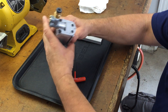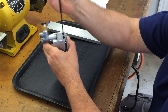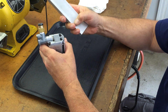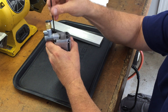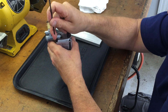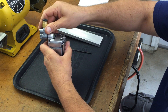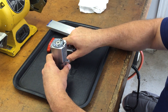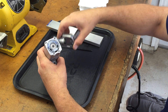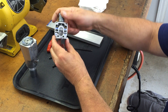First thing we're going to do is dissect this thing. I'm basically going to use the back end of this as the pneumatic switch for the power draw bar. What I have to do is make a new backing plate so I can put two fittings in here to feed your on and off — or your left and right, whatever you want to call it. I marked the off and the on already, so I know which way it would turn when one of these buttons were pushed.